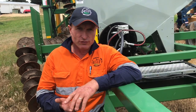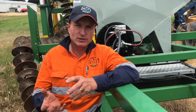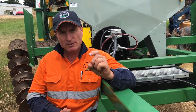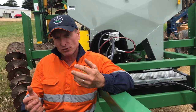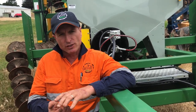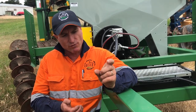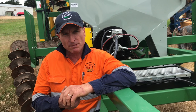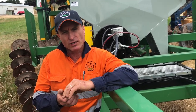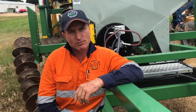The Kelly chain is an awesome tool for doing that because poppy seed is so fine. If you use anything like a multi-disc or offset disc, you actually bury the seed too deep and then you have issues with regrowth coming up years and years later. Whereas the Kelly chain at the right speed crushes the stubble down into pieces, smashes up the heads, but only puts the seed in nice and shallow so that you get a good strike for weed control — very important from a disease management point of view.